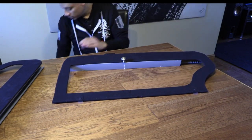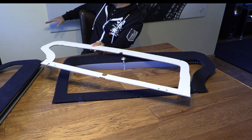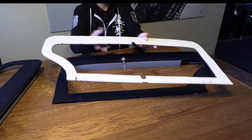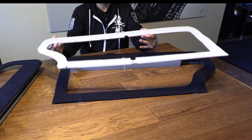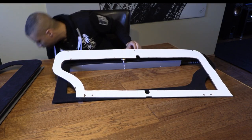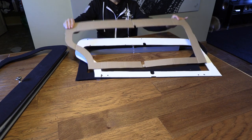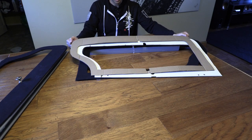The frame itself is made out of — I forget what this is called — but it's some kind of material that's supposed to go on your wall. Usually people put it up so high and then put border around it or something. I don't even know if it's wood or press board, but I got big sheets of this and cut the design out of it. This particular piece is scrap from a design that wasn't perfect, one I had to start over on. Here's the cardboard I made to use as a template. It wasn't quite right because the window itself curves and this was a flat piece of material, so if you don't compensate for the curve it won't be perfect — and like I said, your measurements have to be accurate.